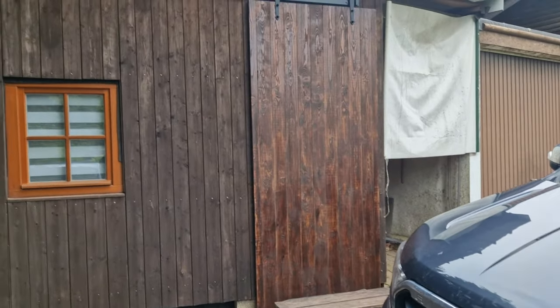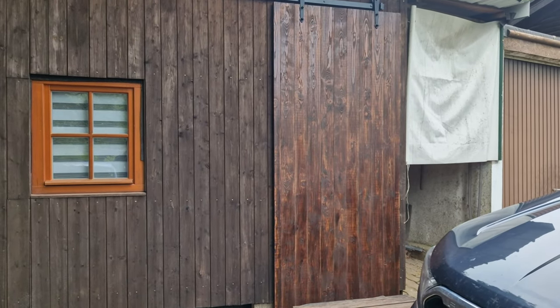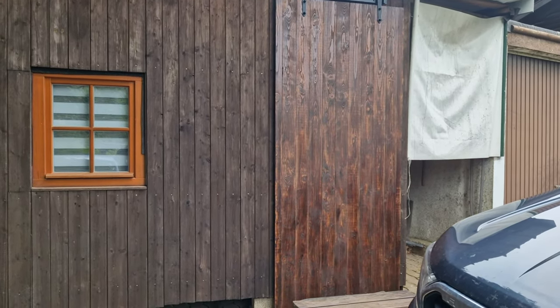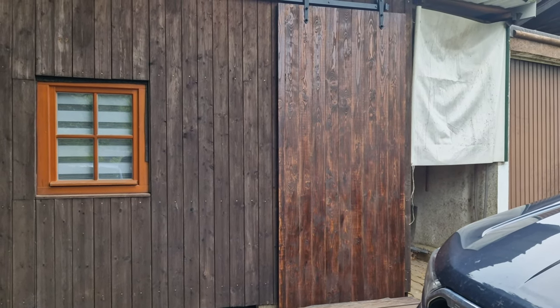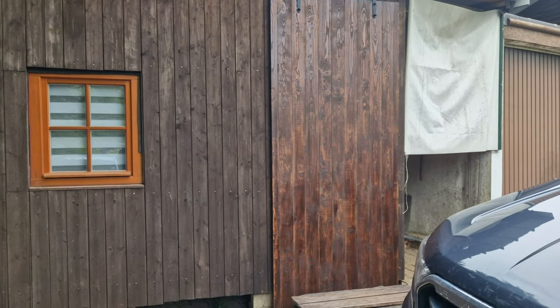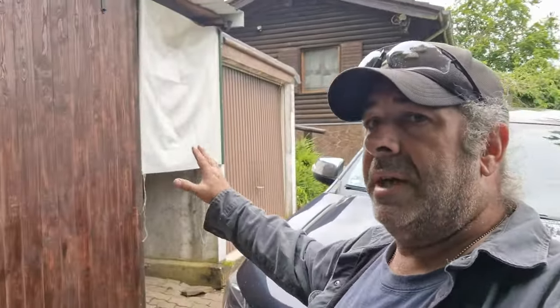You can see that little bit of shine on the door is that combination varnish or polyurethane slash stain. That's why there's that little bit of satin shine on it. It will seal it from water. Which was the whole idea of the door, is that the water will hit it and cascade down. That's why we hid the framework of it inside, because it's a shame, because the inside is beautiful.